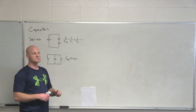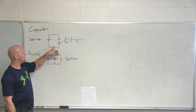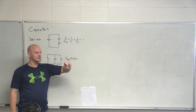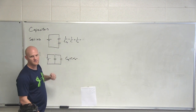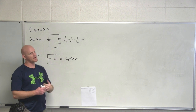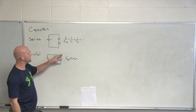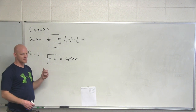My mom talks about when she was a little kid — this says something about how old my mom was, but also how poor she was at the time. Their family had nine lights in the house, and they were hooked up in series. The electricity passes through the tungsten filament of one and then the next. If one of those light bulbs goes out, it breaks the circuit — like the old Christmas lights. With old school Christmas lights, if any one light goes out, the whole strand is gone. Now all the new Christmas lights and houses are wired in parallel, so if any one circuit element goes out, there's still an alternate pathway for the current.